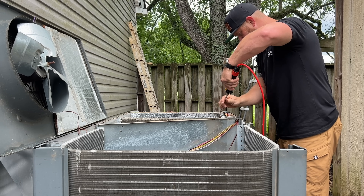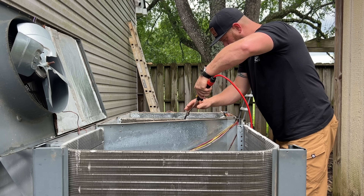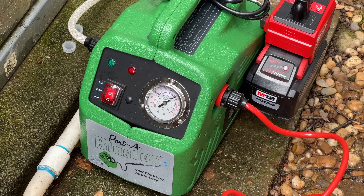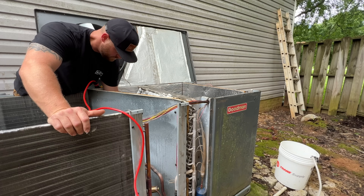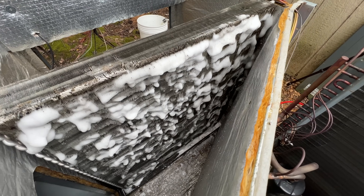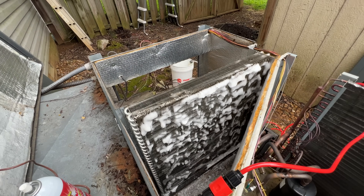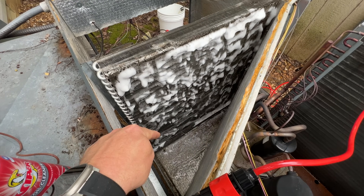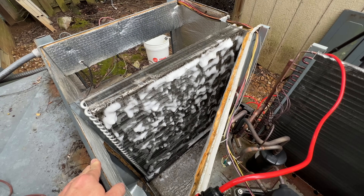What I like to do is give it a little rinse first, then apply some of that coil cleaner — that's really going to help grab all the dirt and debris and get this thing nice and clean. I'm going to let that set for a good five to ten minutes to really pull everything out of that coil, then give it a good rinse. While we're here, it's a good time to clean the drain line and the pan on both sides of the coil to make sure it's perfectly clean.